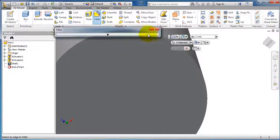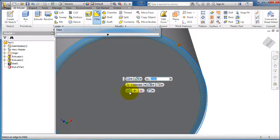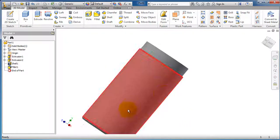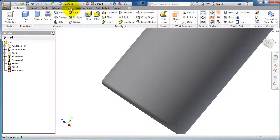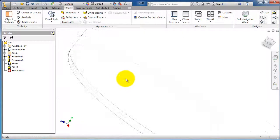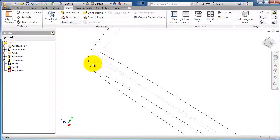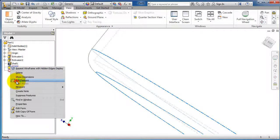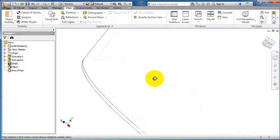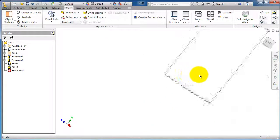The shell is recommended to be less than 1 millimeter — or 2 millimeters — it will be very thin. If we have a look inside you can notice it's kind of very thin. Let's change the edit feature to be 0.5 millimeters, so it looks more logical now.